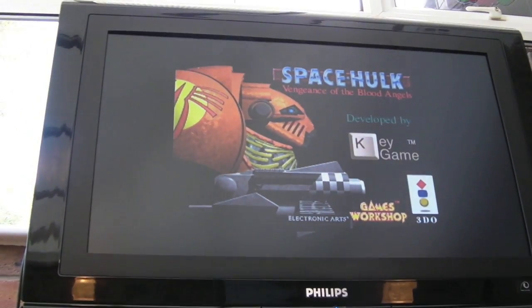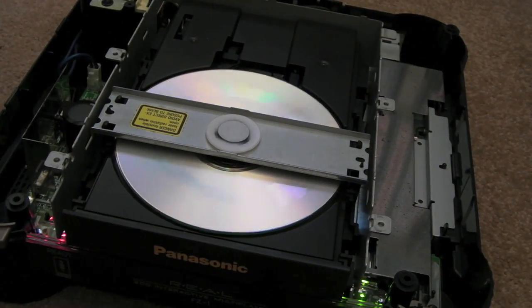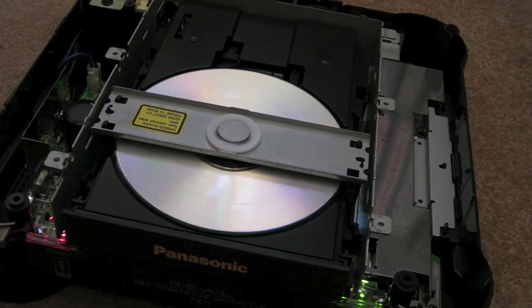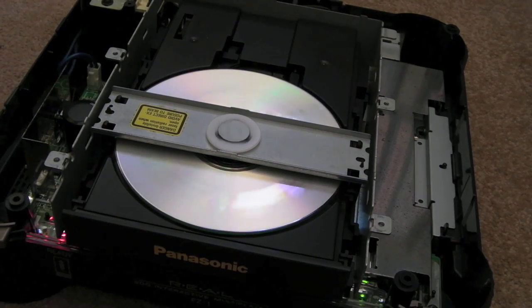That's working as well. So I'm not sure, but I've probably decreased the voltage — you tend to find you need to increase it usually for CDR media. So if anything, I might have extended the laser life a little bit; I haven't decreased it so much that it can't use pressed discs. But I'll do some more extensive testing — it's just interesting, the things I missed.